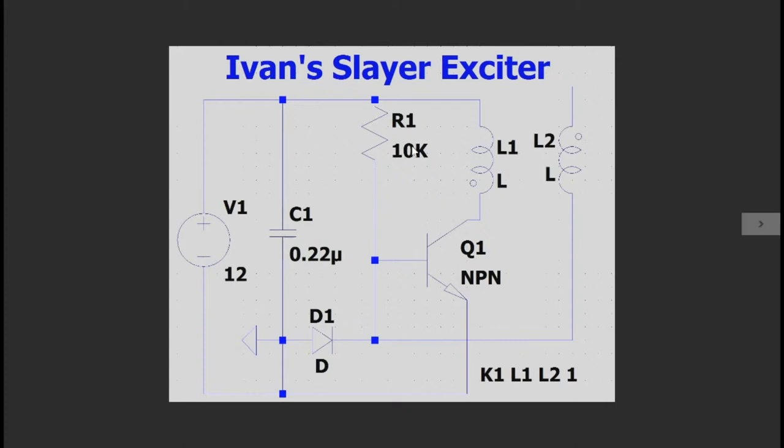by just playing around with a potentiometer and seeing when you get the maximum output power versus when you have the highest efficiency or when the transistor remains the coolest. It depends on your design and what you want to do with the circuit. So to recap, go for 10 kilo ohms if you want simple, and if you're feeling adventurous, play around by all means. It'll be better for you.